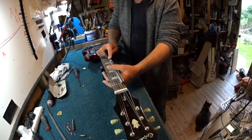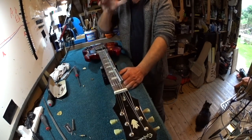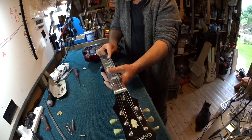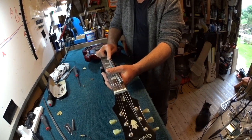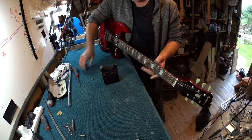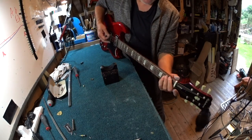But you can still have unevenness or lowness, because a low couple of frets, or a single low fret, can be that it's been hammered in too hard or pressed too hard on the press, or the wood at that point was a little softer than at other places and it's sunk a little lower for the same amount of pressure. A number of things can happen. But the reason it's important is that a low fret makes the frets after it high, effectively, relatively speaking. So you've got a problem if you've got a single low fret. You can even everything out as much as you can, and then your finger or your string goes into that gap, and it has to come out of the dip, and the next fret is effectively high, although it isn't relative to pretty much everything else.